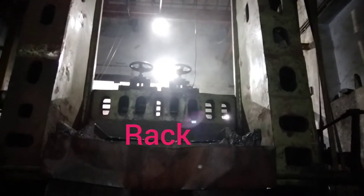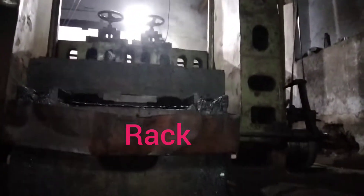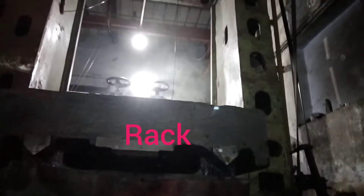You can see here the bull gear is attached to the rack, and the rack on which your table is mounted provides motion transmission. The rotary motion of the gear is translated into the linear to-and-fro motion of the table. You can see how the rack looks — these are the teeth of the rack.